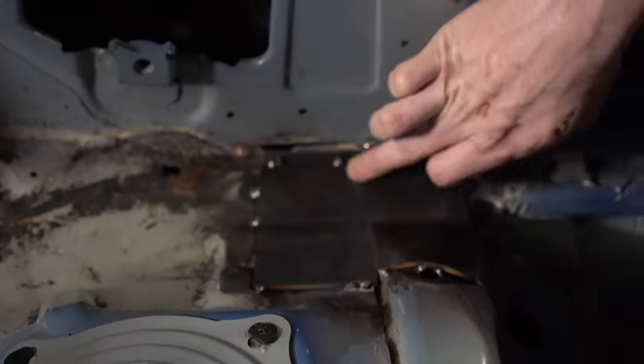And the first thing I'm going to do is the long notches. These notches are 54 degrees each. And the reason I'm doing those first is because if I do those two angles first, bevel them, get them ready, I can cut the straight notch one, two, three times as I'm fitting this piece to get it just perfect. It's easier to remove material off of this notch than it would be this one.